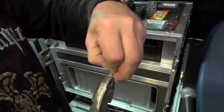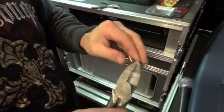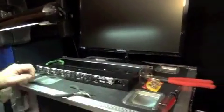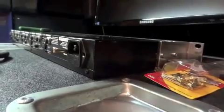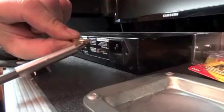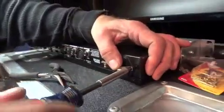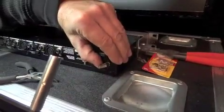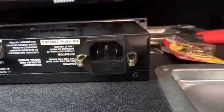From there we're going to take this bracket and re-bend it after the hole that's in it. Then we're going to take this bracket and insert the existing screw that was in the unit into the center of it — sometimes it takes a little finagling. Then we're going to screw this back onto the back of the unit using the existing screws that were there. We'll take this and bend this one back out. As you can see right now, we've got two mounts around the side of our IEC bracket.